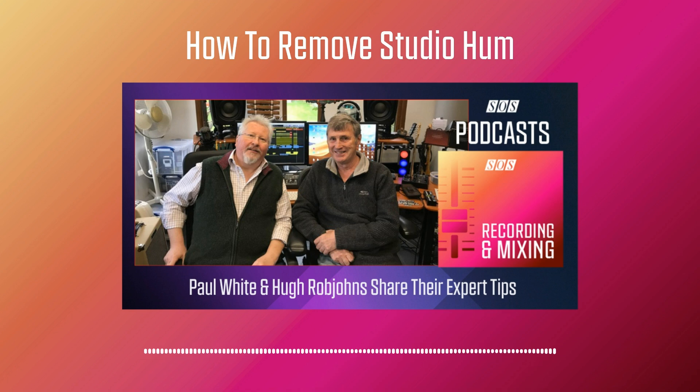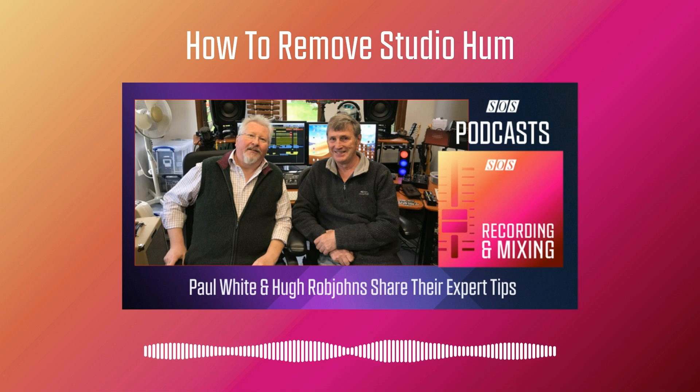After that, you start plugging in your patch bays, hardware outboard, and go through the same routine. You just have to do it one by one — if you hear a problem, solve it, move on to the next one. Often you'll keep plugging things in with no hum problems at all, and then suddenly something you plug in causes all sorts of issues. You have to go through the piecemeal process to identify each piece, cure any problems it introduces, and move on. It's frustrating but necessary. And if you ever rewire something or move a box to a different rack, you may need to go right back to the beginning and work through it again. But if you're lucky, none of that will happen because your equipment was designed well, and as long as you use balanced leads, it should all behave nicely.